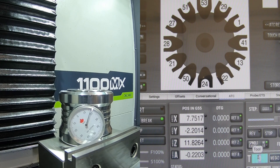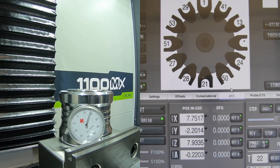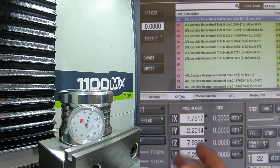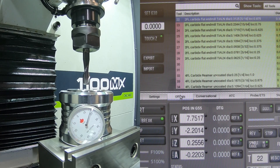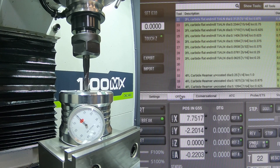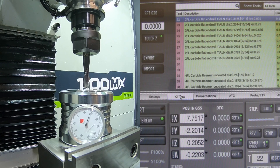I'm going to grab tool number 22. Just gave it a quick wipe on the bottom to make sure there's nothing sticking on there. For this one it should zero out at about the same time — anything different from zero when the tool center is set at zero is going to be that difference in our repeatability. That one is spot on — there is no difference. I did blow past it a couple of times, so I needed to slow my Z feed down a little bit, but that one came in spot on.